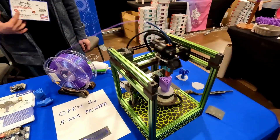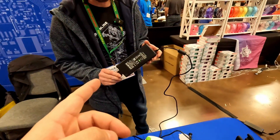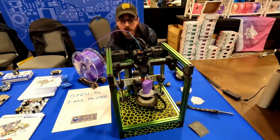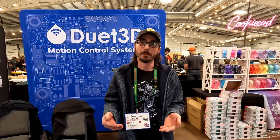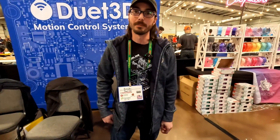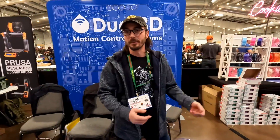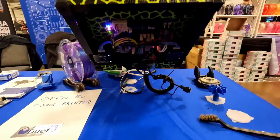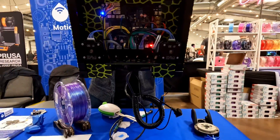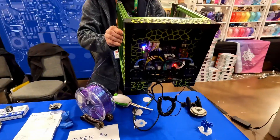And what's powering all this? Right now it's running off of just a 24-volt DC supply. But it turns out if you get a USB-C PD decoy, a 20-volt variety, and a 100-watt USB-C power supply, you can actually run this from a USB-C power supply. There's no heated bed, so all we're dealing with is the nozzle and the seven steppers. We have a Duet Mini 5 Plus, and it has a daughter board on it that gives it control for two more steppers.